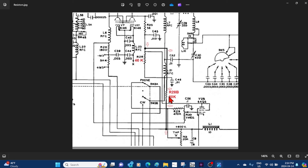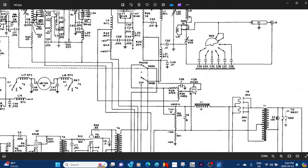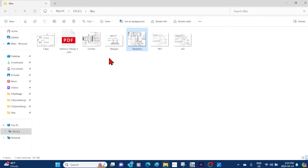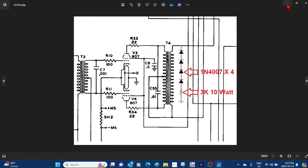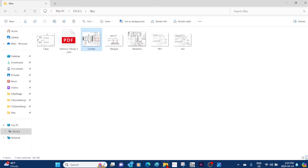Now, like I said earlier, we have to do some other things to protect the modulation transformer. Now that you can over-modulate it, you need to do something about it. So here's my drawing of the changes to the limiter. Here's the modulation transformer, and there are 1N4007 diodes stacked with a 3K 10-watt resistor, just like this. This prevents negative cycle loading.